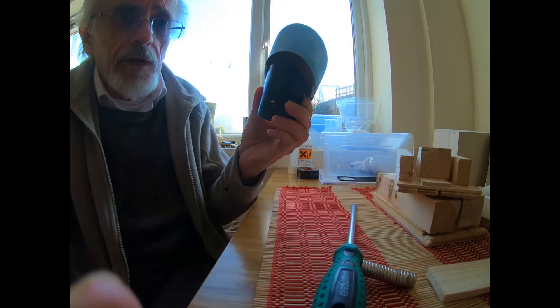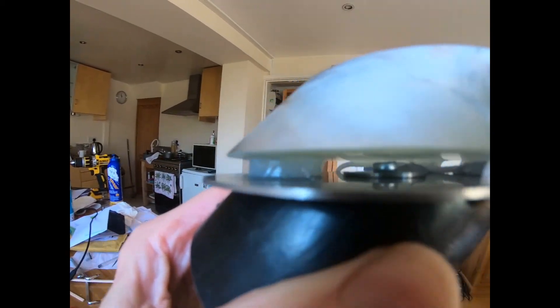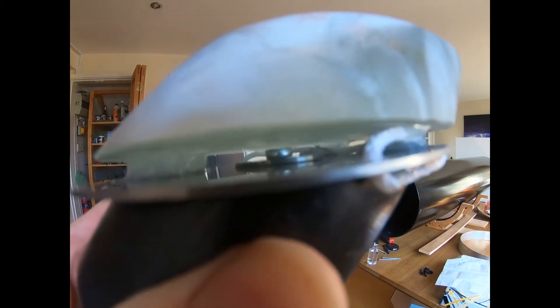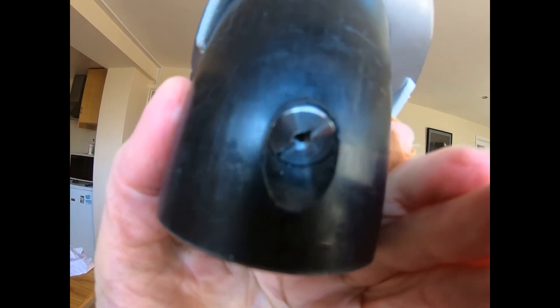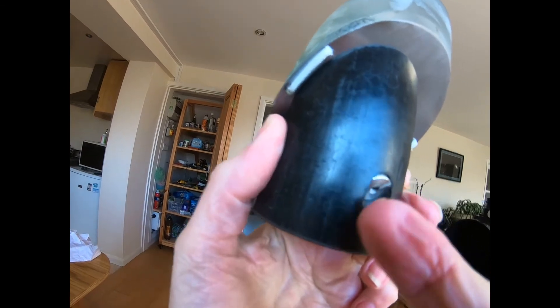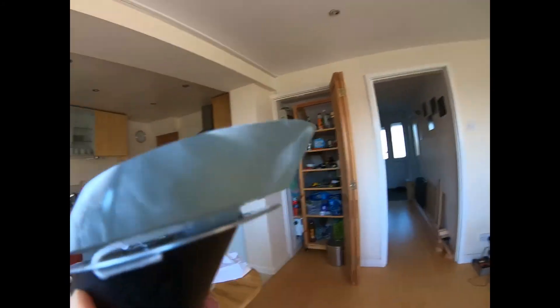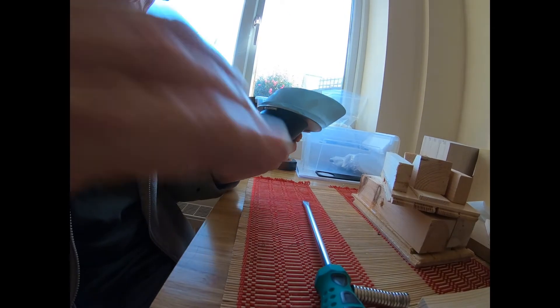There's a little cylinder with a slot in it, threaded, so that I can do things. And if you look just right there against the white background, you should see a metal washer and a bolt head — I ground that down so that it was not going to touch the glass. It passes through and is attached to the other end. If I tighten that up, it will pull the bolt downwards and pull the steel plate tightly against the support.